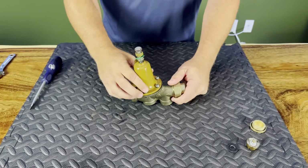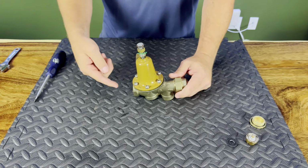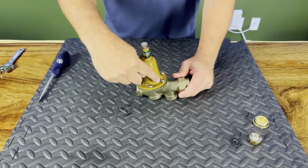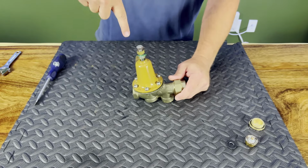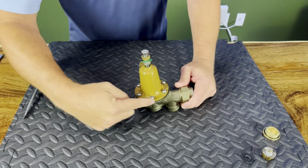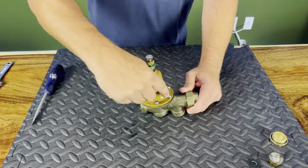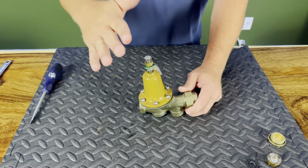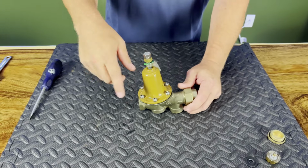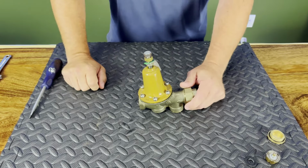All right, so we got our cone on there. We got that nice and stable. What you want to do is screw these in, and then also just do it like you're doing a tire. Tighten this one, back and forth. Don't just take an impact wrench and start screwing this side down, because what it's going to do is, remember, this is just brass, so it'll start bending. So you always want to tighten it back and forth, get it into a nice pattern, get it tightened down, then one time around. But again, by hand, you don't always need an impact wrench to do everything.